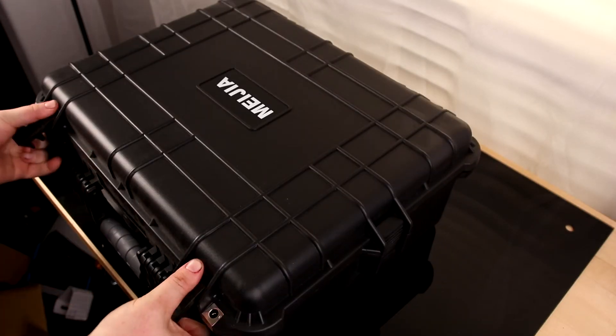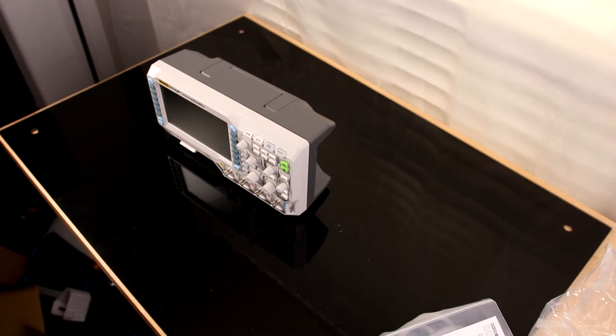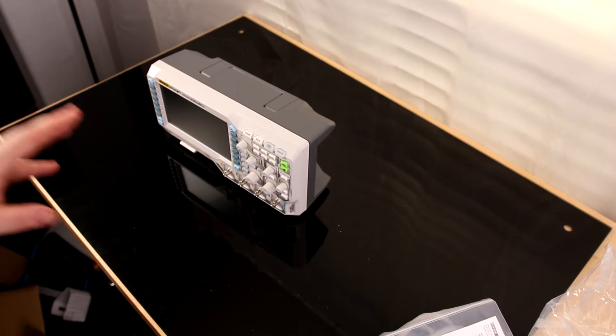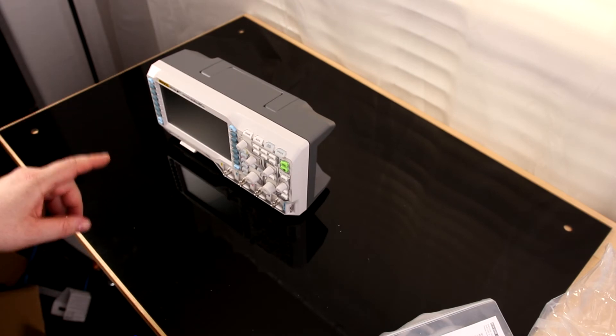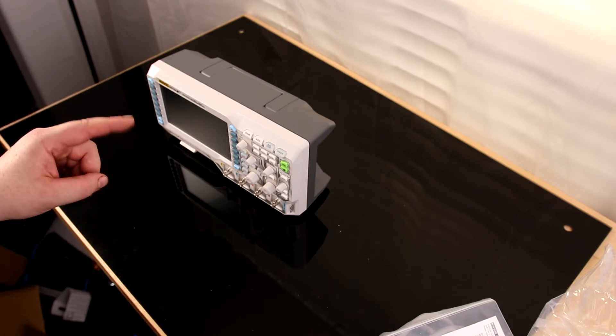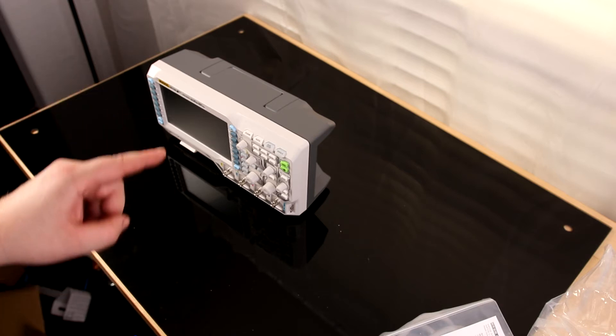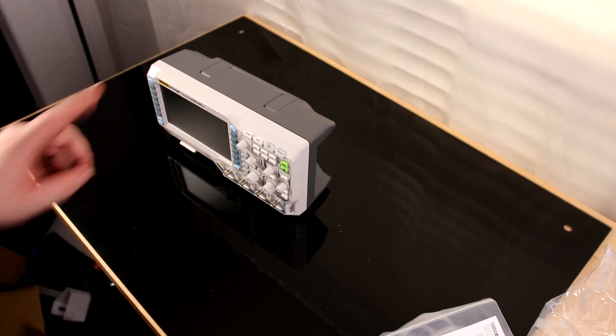It's time to break out the big guns. This is an oscilloscope, and I want to check the actual sine wave coming out of that inverter. The reason I want to check is because when I turned on that soldering station, I noticed it was rattling, which usually means it's a square wave, not a sine wave. So I'm going to check that right now.